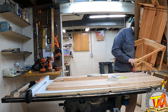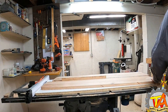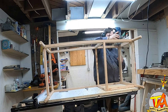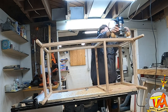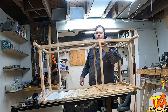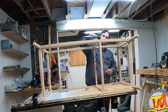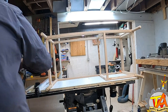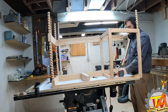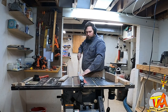Tim glued up the desktop sections somewhere off screen but apparently forgot to record it. I used a groove bit in order to make a groove along the back wall of this desk — in my mind this was a perfect idea for making the grooves to slide in the paneling. However, I felt the process was too dangerous, so I marked all of the edges that needed to be grooved, took the drawer frame apart, and Tim decided to make the grooves using the table saw instead.